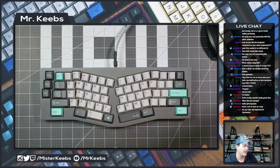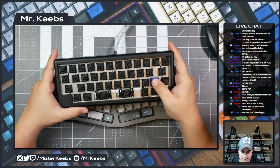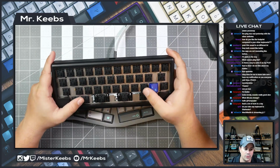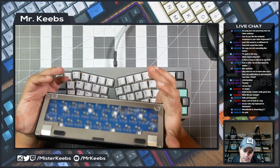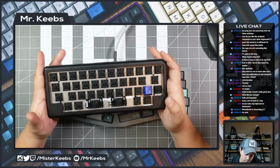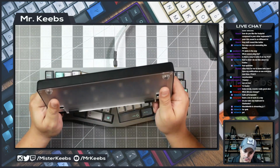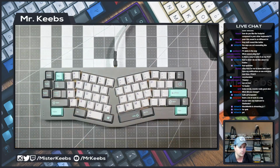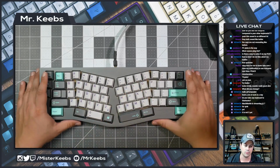Yes, I do. I take one very, very similar to this that I just realized doesn't have caps today. But here's what I did for my keyboard. This is a Daisy keyboard. And on the one that I take out, I replaced the PCB with a Chicory 40 PCB. So it's a Bluetooth keyboard on a very small form factor like this. It's a 40%. So that's the keyboard that I take with me when I work outside. And then I use that option on the MacBook to lock the keyboard if you're using an external keyboard, so the built-in keyboard doesn't work anymore.